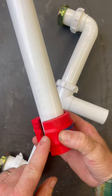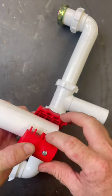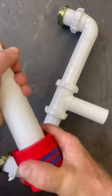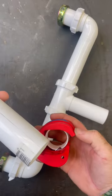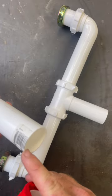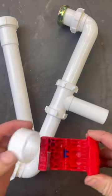All you have to do is put the pipe on here. There are arrows that indicate the direction you need to turn, as well as a little sight right here to see where the line is that you want to cut. Then just rotate the pipe around the tool until it cuts all the way through, and you not only end up not breaking the pipe, it does a beautiful finish on this. You can put it right together without any of the hanging up that you get when you use a normal pipe cutter, or the risk of breaking it.